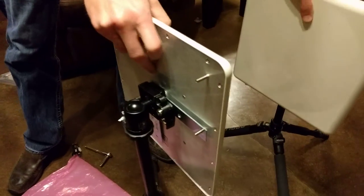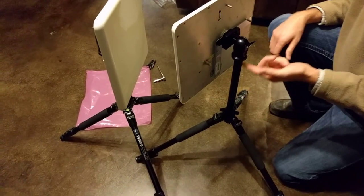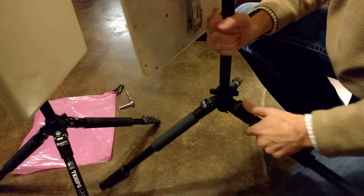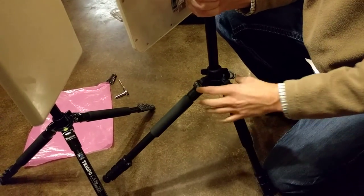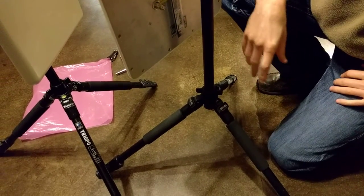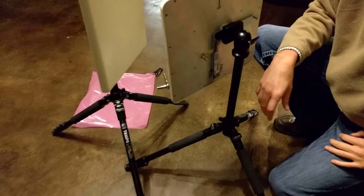So that's both of the antennas and tripods. One final thing: when you set these up on the finish line, make sure you extend the neck all the way to the top. The tripod legs have three different levels. You want to go the next level down from flat — if you go too narrow and have a strong gust of wind, it'll blow over. That's how far I like to spread my tripods out. This is a good height so that if you get tags on the shoes or on the hip, this will pick them up really well. This is how your tripod should look when you're done.